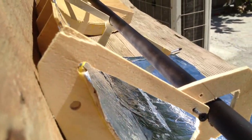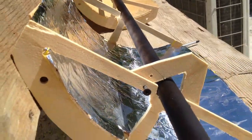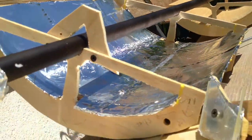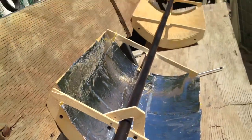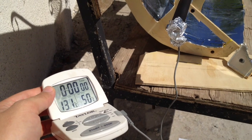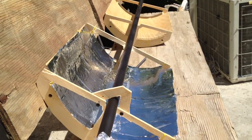Copper is a great conductor so it's conducting heat to the rest of the pipe that doesn't have focused sunlight on it. You can see the concentrated sunlight at the bottom of the pipe. It isn't reflecting a lot because this black paint is meant to absorb all the heat and light — it's working very well on this thin pipe. It's 131 degrees now, so there's a huge amount of energy going into this pipe.